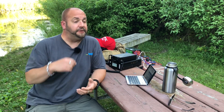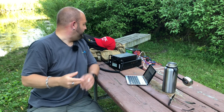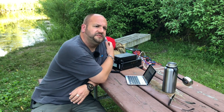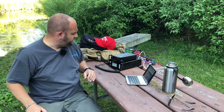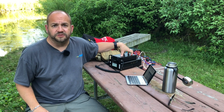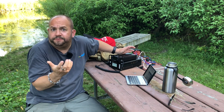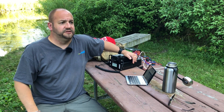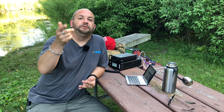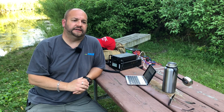I don't see myself bringing this amplifier out portable all the time, but for the guy that wants a QRP rig to take out and wants an amplifier at home, this is definitely doable. I've been operating for about 45 minutes — this says I've used 2.5 amp hours. Peak amperage was about 13 amps on 20 meters, and wattage was going about 80 peak. But 160 through 10 meters we tuned up. It's a heavier loadout than I've usually taken lately, but it works — here's a $1,000 kind of two-radio-in-one solution. A couple guys questioned the spectral purity of this, so I'm going to take this into the lab and we'll look at that in the next video.